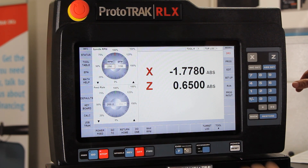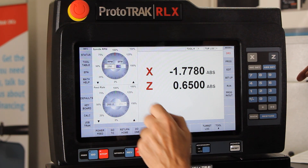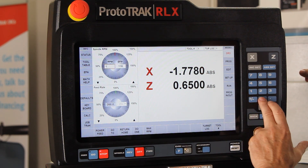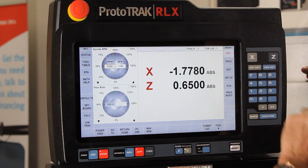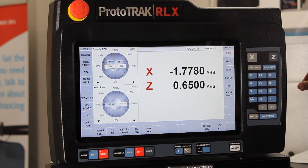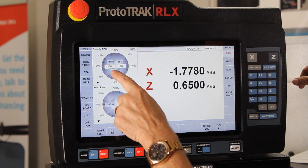The next thing I want to talk about are the feed and speed wheels. They both work the same way, so I'll explain it on the spindle RPM. You'll notice you can program in RPM or in surface footage — whichever one is highlighted is the one you're using. If I want to change the RPM I simply touch that box, plug in a different RPM rate, and when I hit the absolute key it will change to that rate and that's what it'll run at. I'm going to change this back to 250 just to keep it quieter.